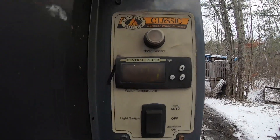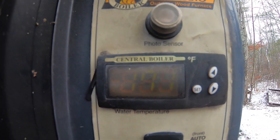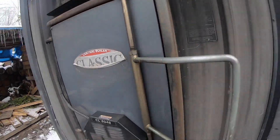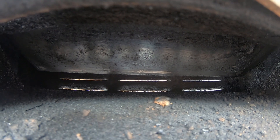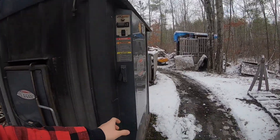There's a damper on the door that opens and closes — I'll attach a little clip so you can see it opening and closing. That heats a fire up. There's water in here that we need to heat to a range of 170 to 180 degrees. Right now this water is at 171. As soon as it hits 169, the damper opens up, allows air in, stokes the fire up, heats the water up, and then shuts off at 180. There's a misconception that these machines have a roaring fire 24/7 — that's not the case. This machine cycles just like your heating system at home.